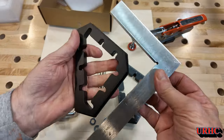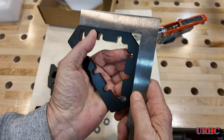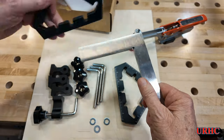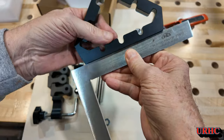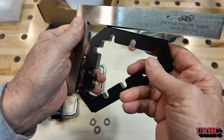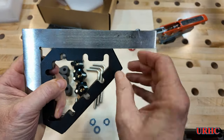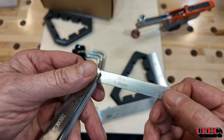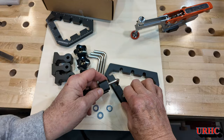Let's get the precision square out and check them. This one here is actually perfect — perfectly square, and that edge is perfectly straight. The other one has some issues. First of all, you can see it's kind of rounded — not quite perfectly straight. It must have been something in the manufacturing process, and it is out of square slightly. Probably within woodworking tolerance — let's see, it's out 0.015. So it's really not out by that much; definitely within a tolerance for woodworking tools.